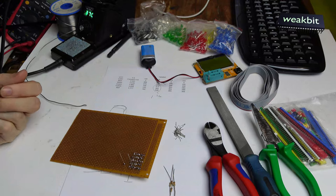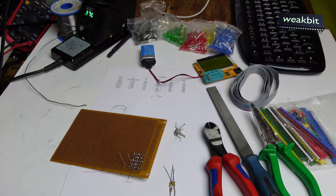We insert the processor. I mean, it's not a processor, it's a microcontroller. The difference between a controller and a processor is that a processor has an operating system. It's not a must, but it is so. And a controller has only one task. It's a hard-coded program in memory, in the flash memory. That's the big difference. Controllers are for washing machines or video recorders, CD players, etc.